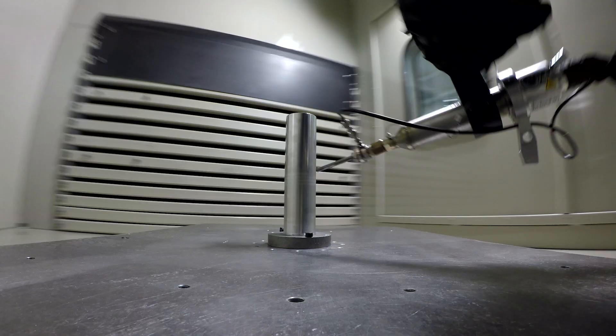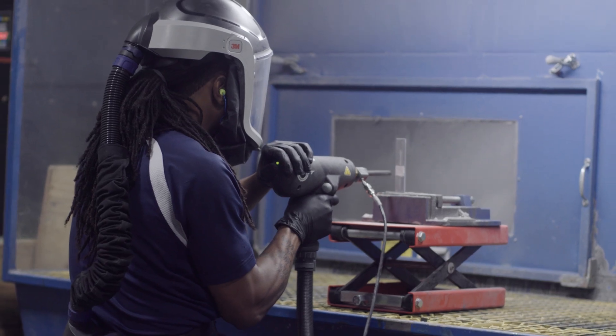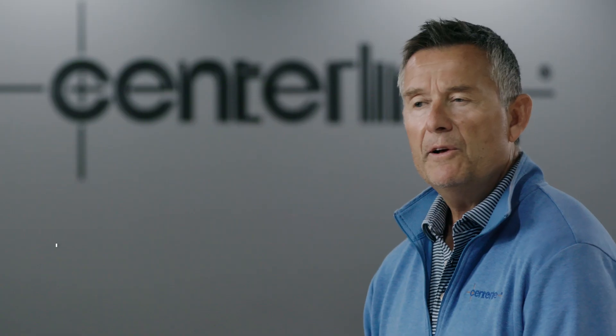That's very unique — the powder feeding into our nozzle. The cold spray technology with the SST line has been a need in the industry for a while. There's thermal spray equipment out there that works well for some of the harder alloys, but there are always limitations and always heat risk. With the Centerline SST system, it provided a lower-temperature alternative that still delivers advanced coatings while avoiding the tempering effects on some of the alloys we were working with.